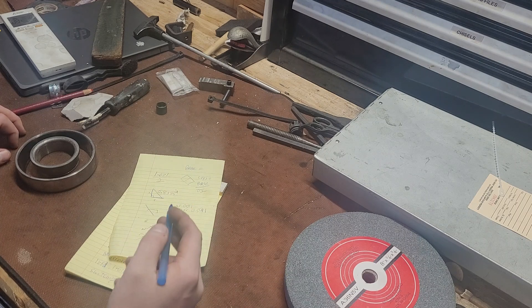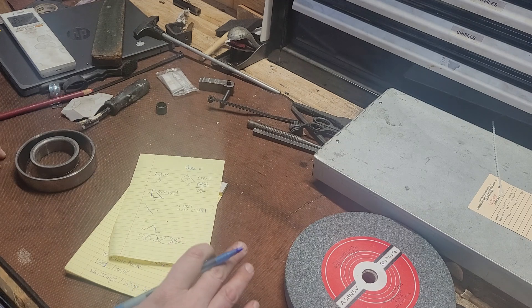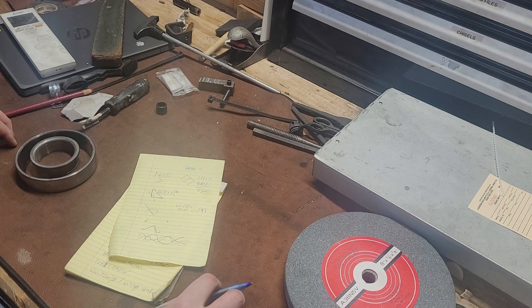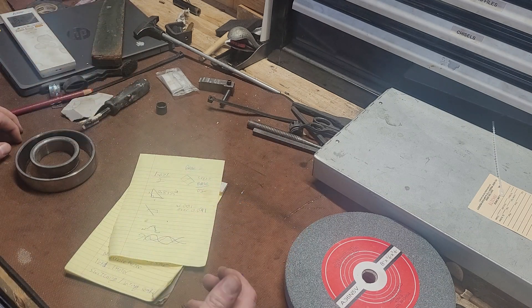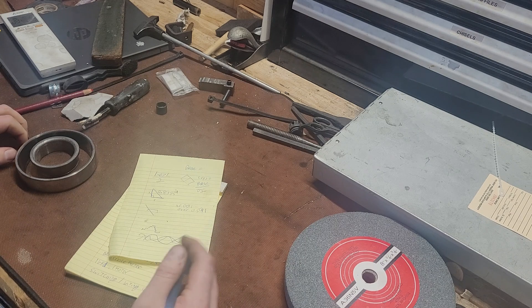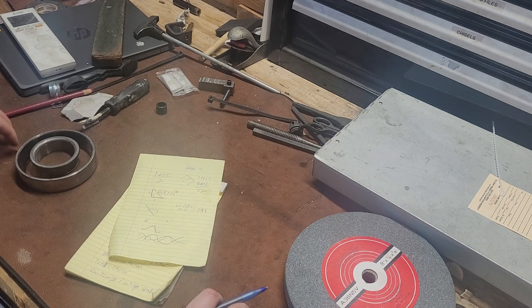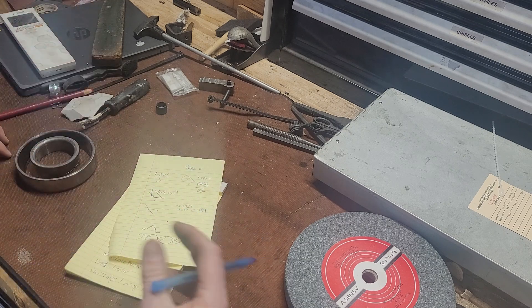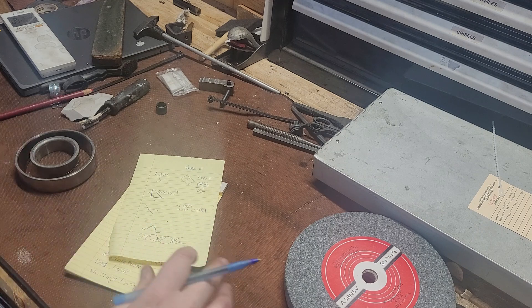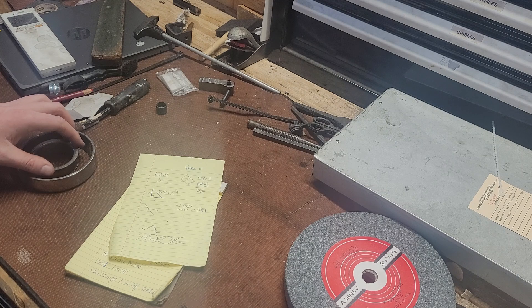Which is why you can use it to convert single phase to three phase. Technically, if you're running these off 220 single phase, it's really 220 split phases. Because at least in the U.S., we have two 110 or 120 hots depending on where you are. My outlets in this shop — each leg on my 220 nominal is 118 volts, so I have about 235–236 volts in those plugs.